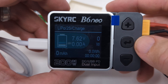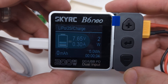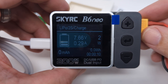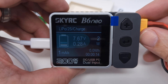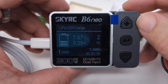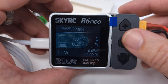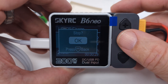Once you set the charge current and all the other settings, you just hit start. You'll go to a screen that shows the battery voltage and how many milliamp hours it's put into the charge — that's a good number to look at if you've really killed your battery, to get a rough idea if you've reduced its capacity from running it too hard. Normally it'll stop on its own and say done, but for this video we're going to hit stop so I can show you balance charging.